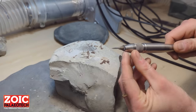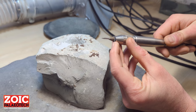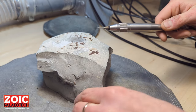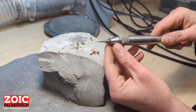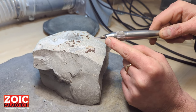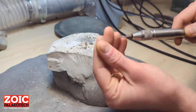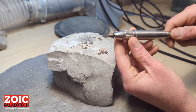You will notice in front of the pen you have an o-ring. This is the diffuser o-ring, and as its name suggests, it diffuses the airflow over the tip to help clear away chips. When working on fragile fossils, you don't want as much air over the tip, so you want to have this on. If you are just roughing material out, you can remove it for a bit more power, however at the expense of much more noise.